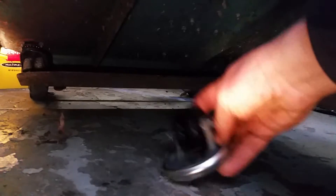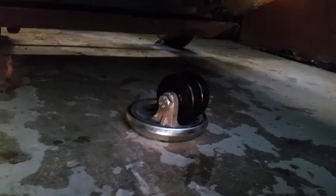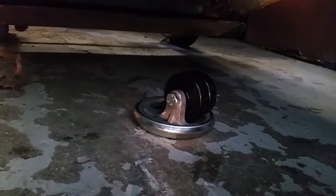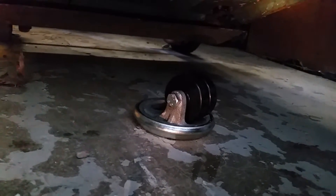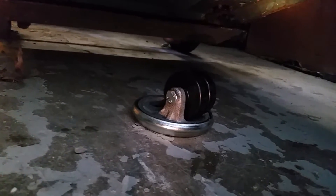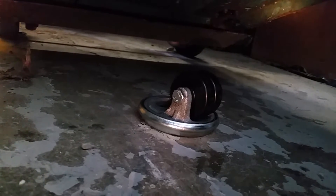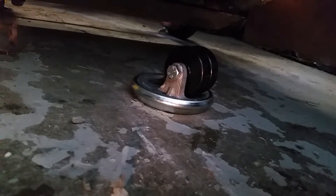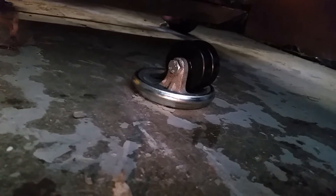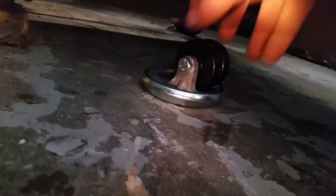Introducing this guy here — this is from Revo, R-E-V-O. I found these in the Grainger catalog. They are pretty heavy duty; I like them a lot. You have to realize this Bendix weighs a thousand pounds, so each caster has about a 250-pound load — a little variation depending on the center of gravity. These are rated for 350 pounds apiece.